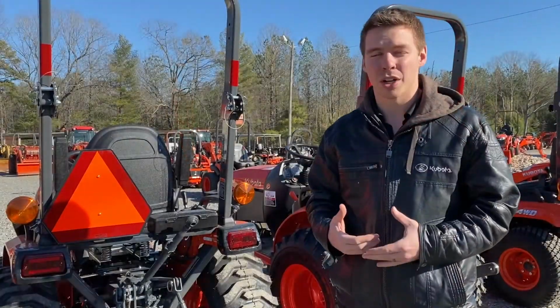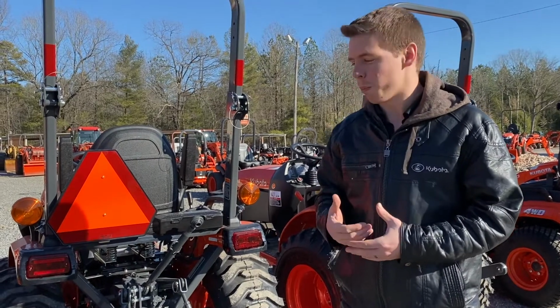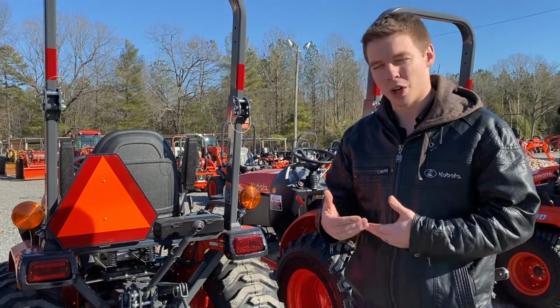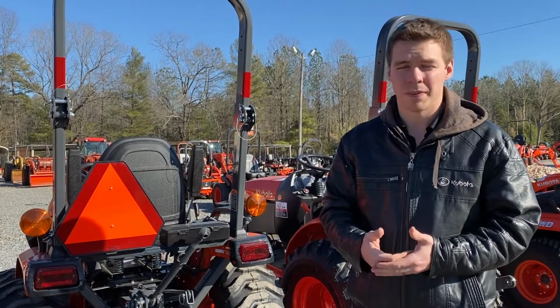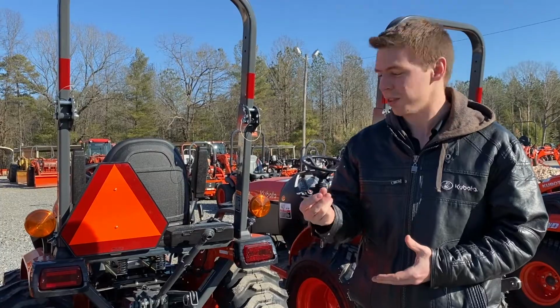It's not going to be as aggressive on turf, but the downside to this tire is it will pack up really easily with hard mud or snow. So you'll start slipping and sliding versus the agricultural style. But if you're running on concrete, pavement, or grass, it's a very good option. Very good for puncture resistance as well, because again, thick ply, thick cleats.